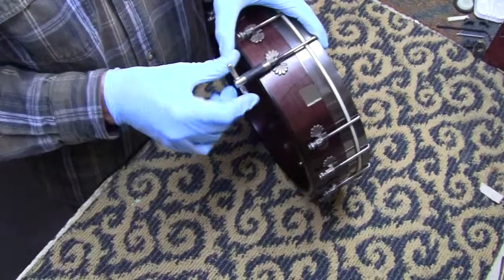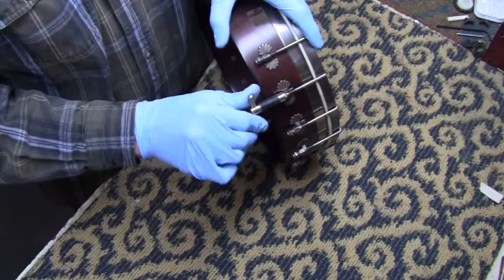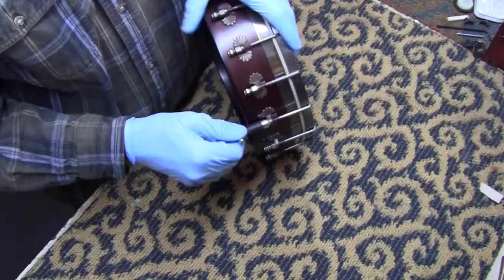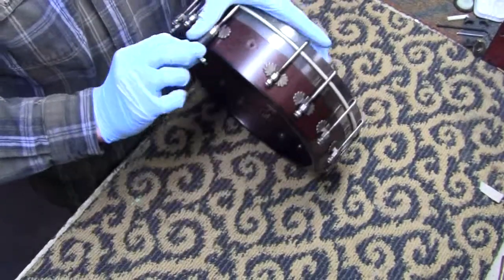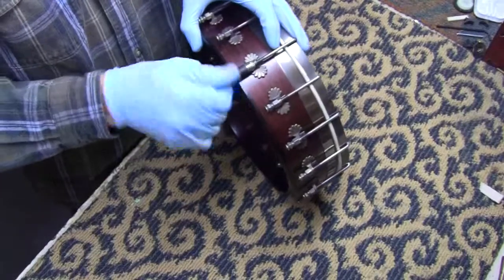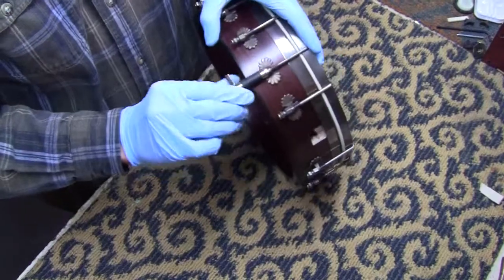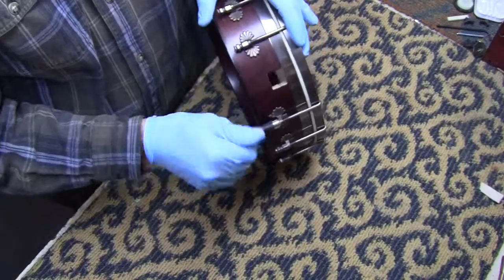And I do that by feeling. Like this one next to the dowel stick is on pretty tight by the feel. So is this one. This one I just put on is loose. So I'm just bringing it. That was really loose. Another really loose one. Okay. That was a little tighter. That one's really tight because that's the end bolt hole. This one's tight too. This one's a lot looser. That one's a little tighter. Pretty loose. That was really loose.